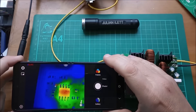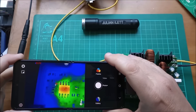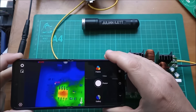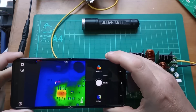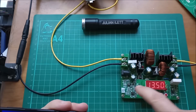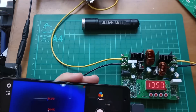The legs of the chip are fairly reflective so they're showing up as basically what is being reflected in them, but the body of the chip is quite warm — the temperature there is 40 degrees in the centre of that IC. That's a small buck regulator IC and it's the main power supply for all the electronics, including the microcontroller on this unit.